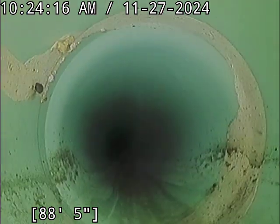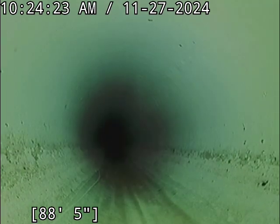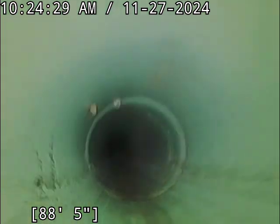The fact that we've got SDR piping out to the street indicates this line has been replaced. This would have been clay when the house was built — from like 1905 or somewhere in that era.